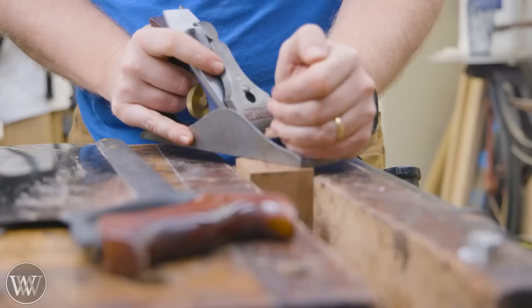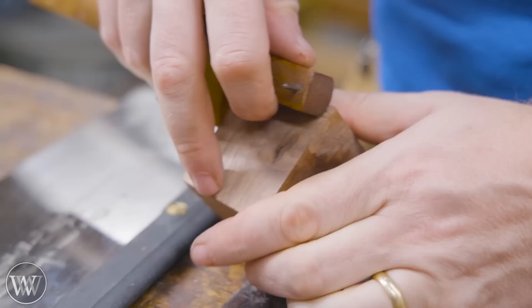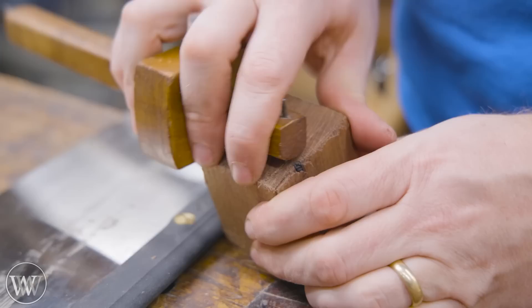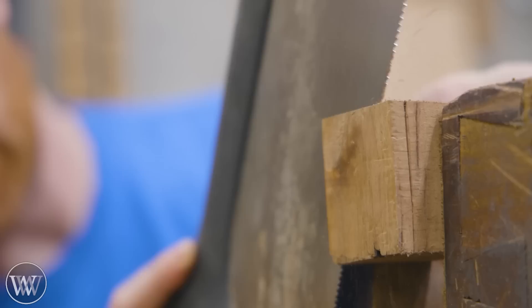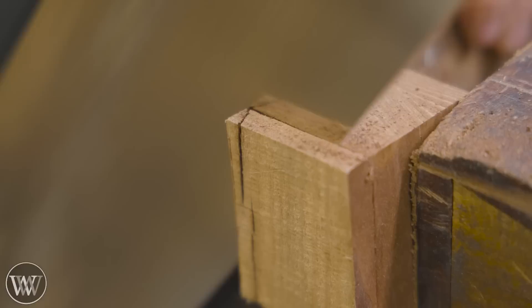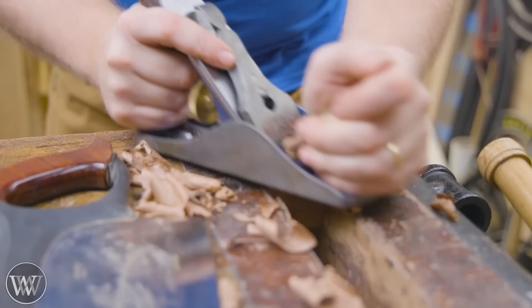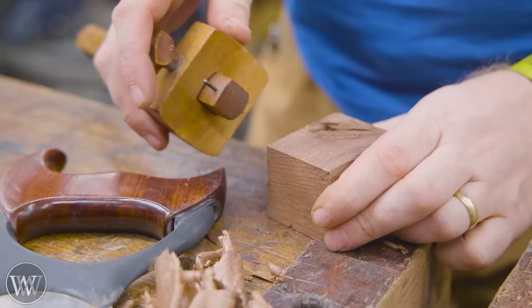Speaking of the block of wood, I'm going to grab this piece of walnut — a small scrap I had left over. It has the pith going through it, so we're going to shave it down and make it a little bit smaller. I need a reference face and another reference face because we're cutting it square. I'm going to rip it down and take it to its final width, basically trying to take that pith out. The more I cut it off, I realized the pith goes at a weird angle, so we're going to work around that — maybe I'll make it a feature and fill it with epoxy or something of that nature.